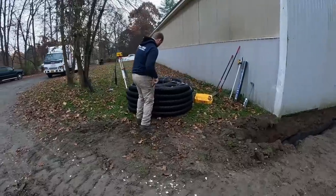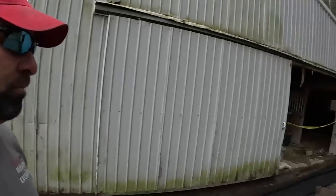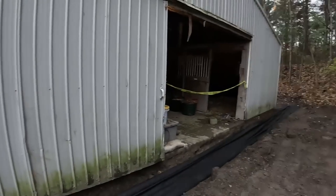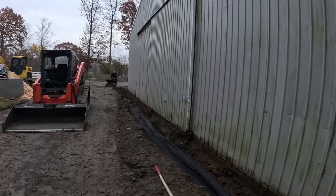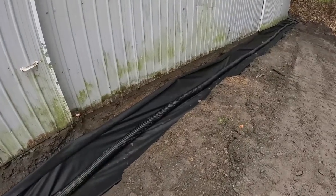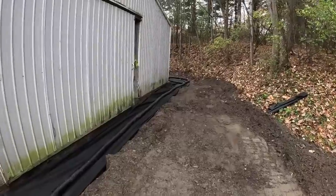Back on site getting the pipe cut, got the fabric going. Did a little homework last night and figured out how to do the slope on the laser. There are guide marks on the top of the laser that have to be lined in down the trench. We checked everything and it was all within a half inch with that slope setting. We'll stretch the fabric out, lay it along the bottom of the trench, pipe goes in, then stone. We're stapling the fabric to the walls - that keeps water from going into that building and channels everything to that pipe.